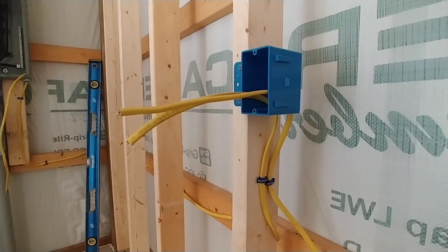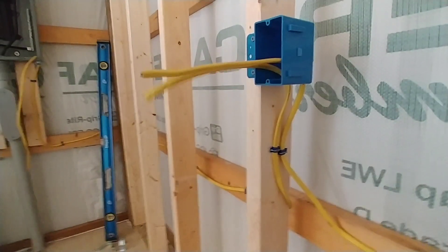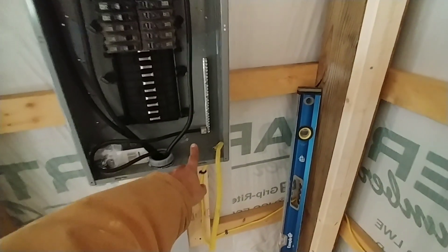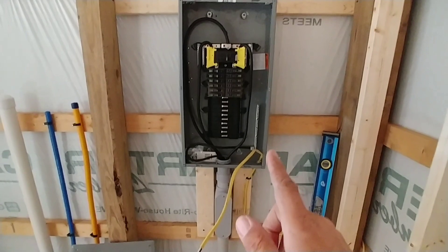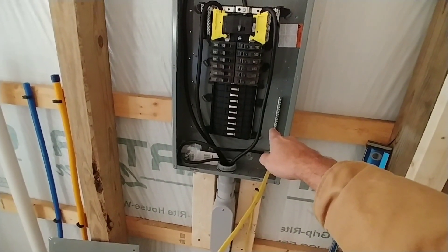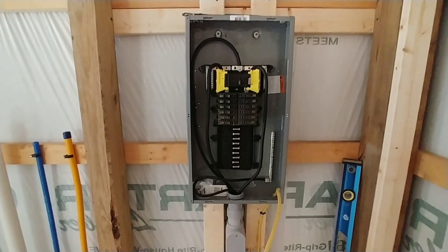When you're getting your rough-in inspections, they're going to want to see at least 6 inches of wire hanging out of each box before you put your outlets on them. So during your rough-in, you always want to have a little tail like that sticking out. When putting your wires in your panel, what I always like to do is wherever the wire is entering the panel — in this situation it comes in from the bottom — I make sure the wire will actually extend all the way to the top. The reason is that once that wire goes into your panel, you want it to be able to connect anywhere it needs to go — to your breaker, to your neutral bar, and to your ground bar.